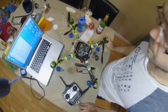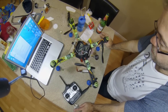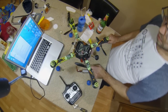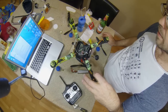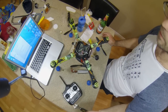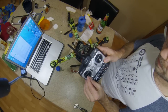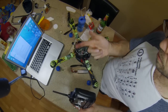Someone asked about how to calibrate the ESCs, which I've only ever done once in my life and it seemed to work — it fixed the problem where one of my motors wasn't spinning. Just so you know, it still occasionally stops if I power up really slowly, but it's never happened above about 10% throttle, and I'm never below 50% when flying anyway, so it couldn't happen in flight.